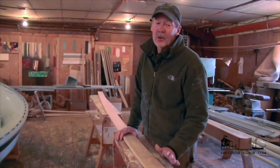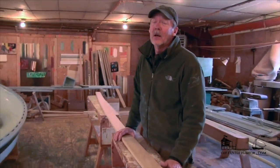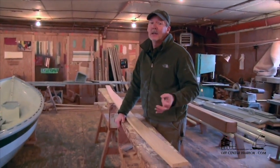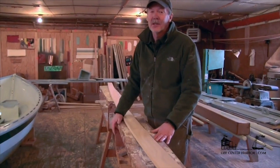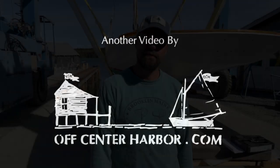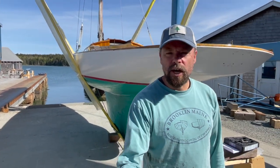They're just an invaluable shop fixture. In actuality, I built Ned Ludd on a carport with these as my only shop fixtures — a pair of Manning benches — and I was able to plank, spar make, mill, and build molds. Under duress you can put them side by side, put an eight-foot sheet of plywood on them, and have a four-by-eight workbench in about a moment. Thanks for watching — if you like it, there are hundreds more, just follow the link below.